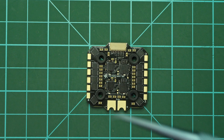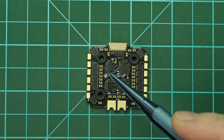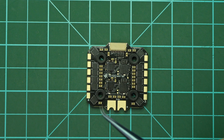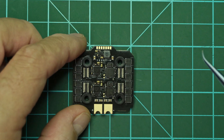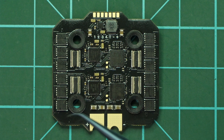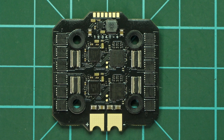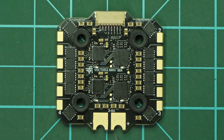This is the Voltara Mini 50A ESC. It follows the same vision I had when I made the 70A — don't compromise on quality, but focus on using the best components available and innovating on the PCB side of things, where a lot of magic happens with Voltara ESCs. As you can see on the backside, I'm using the same approach as the 70A: 4 shunts to measure each ESC's current so that the code has more information to step in when needed. You can expect the same level of quality as the 70A, just in a smaller form factor.